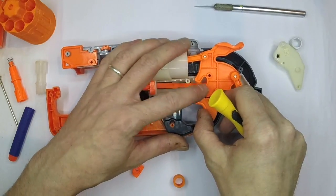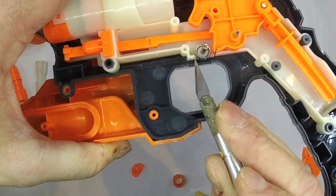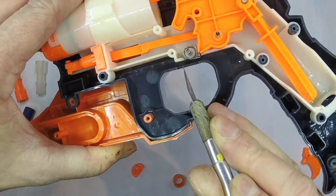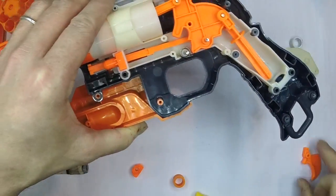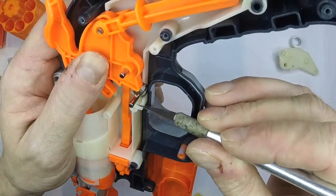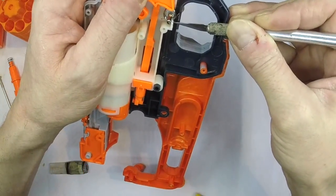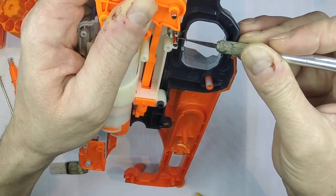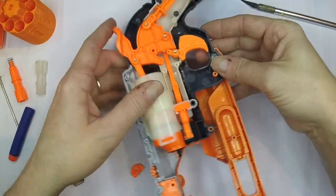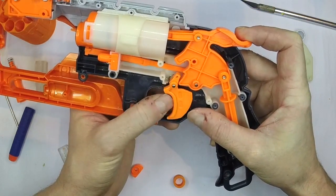You're also going to trim a little bit just where the trigger rests. You can see there's a step — it goes along and down — and what you want to do is trim from the higher part of the step to allow the trigger to go further forward. That will much more positively engage the sear, which is the top part here. You can see the shape of the sear block — it'll much better engage into the hammer. It's about a millimeter you need if you're doing it for the blaster parts kit. For those of you who have accidental discharges with your Hammer Shots, this is how to stop it.